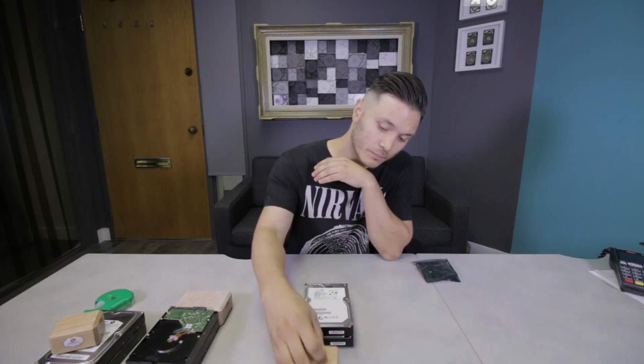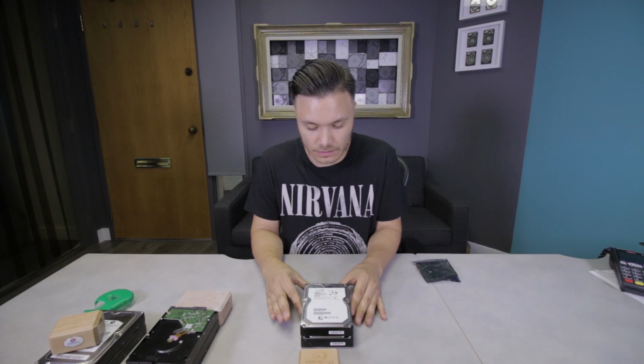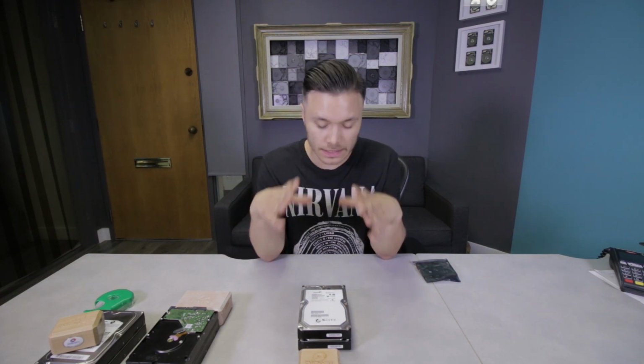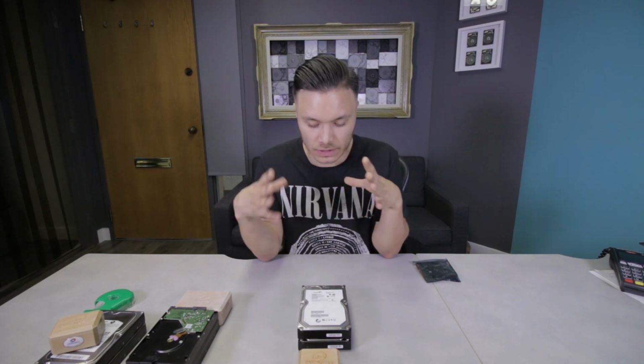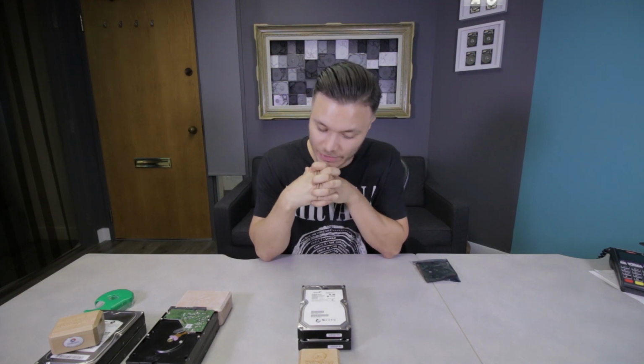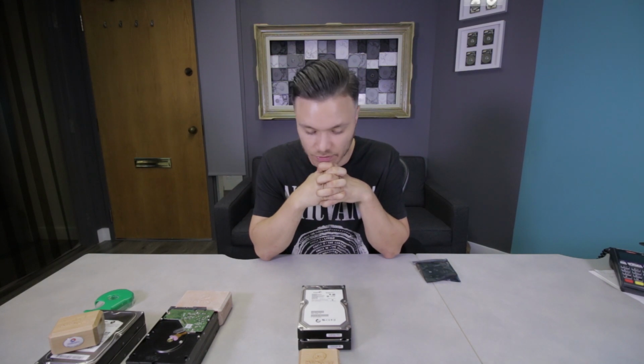And for that, I'm gonna use the regular 7200.11 and 12 four platter kit. This drive is clicking, but it's not clicking like heads are completely dead. It clicks constantly, and even every now and then it makes a sound like it's just gonna catch it and it's just gonna run, but it doesn't. So I'm guessing the heads just started to fail recently, and maybe it's not even related to all of them.